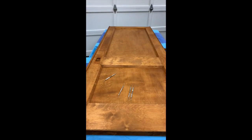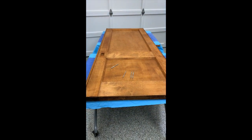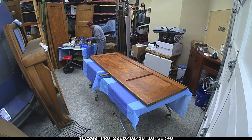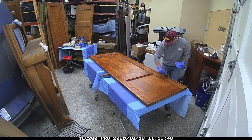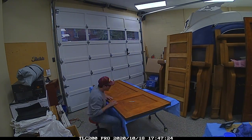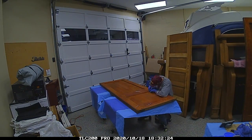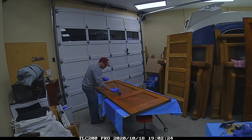It's a bit of a tedious job, but I think the end result is certainly going to be worth the preservation of some of these unique items to the home. Use a natural bristle two-inch brush to apply the water-based polyacrylic. Put three coats on, and sand between each using a tack cloth to remove any small particles after sanding and vacuuming. As you can see, there are multiple doors and multiple sides to do.